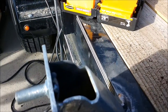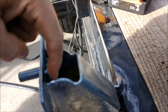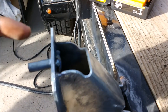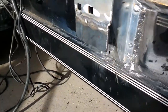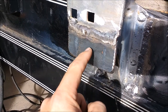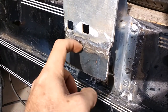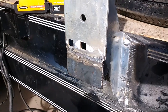As far as the bolt goes, I probably made a mistake and tack welded it in just three little places — barely tacked it. That'll hold it in place. I should have just bought those little push-on washers. For the lower one, I'll go ahead and drill it, push it through, and tack it in a couple of places just enough to hold it. That way if I need to remove it, I'll just cut it off with a cutoff wheel and knock the rest through.